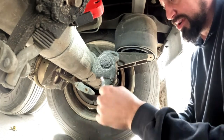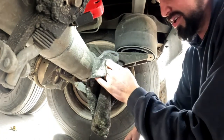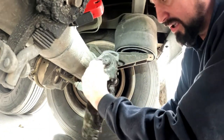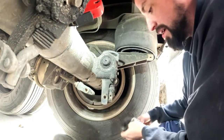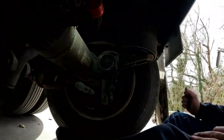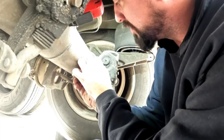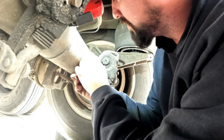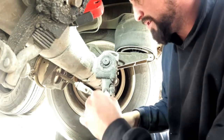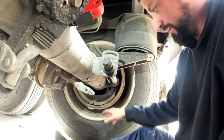As always, if you have a properly maintained one, you're going to want to grease it out before removing the snap ring. Just so we can both see it, we'll get it cleaned up so we can get the snap ring off. She's been greased fairly liberally, so it's a good sign this is coming off easily. Let me go grab my snap ring pliers and I'll take that off and show you the replacement process. There — pull your snap ring off. Should be a washer here, then the slack adjuster.